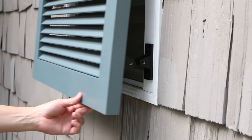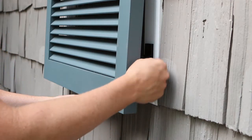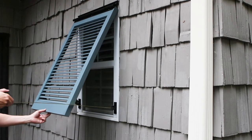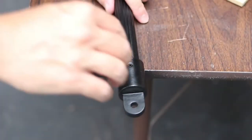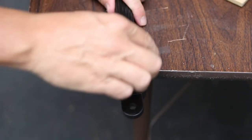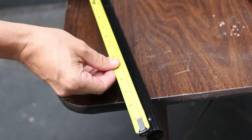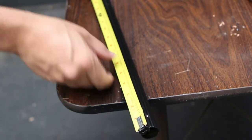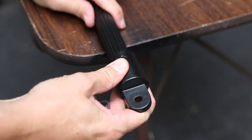Confirm the brackets will nest together. Lift the shutter to the desired angle and measure the distance from the end of one bracket to the other. Release the tension screws on both sides of the support arms. Subtract 4 and a quarter inches from the desired throw. Measure and cut the central aluminum arm to that length. Replace the end caps and loosely tighten the tension screws.